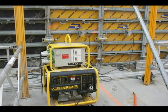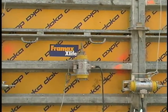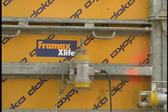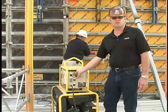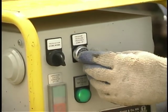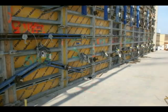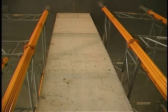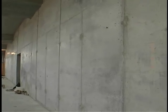The inverter drives the motors at any speed between 0 and 6,000 vibrations per minute, allowing an operator to select the correct speed for the formwork and concrete. A single operator can manually or remotely control the inverter — turning motors on and off, increasing or decreasing speed, and ultimately overseeing the entire pouring and finishing operation. Consolidation is quick and very consistent, eliminating guesswork and eventual rework caused by improper techniques that often lead to honeycombing, bug holes, and similar surface defects.